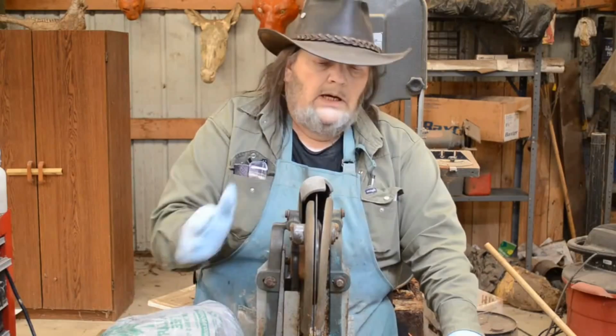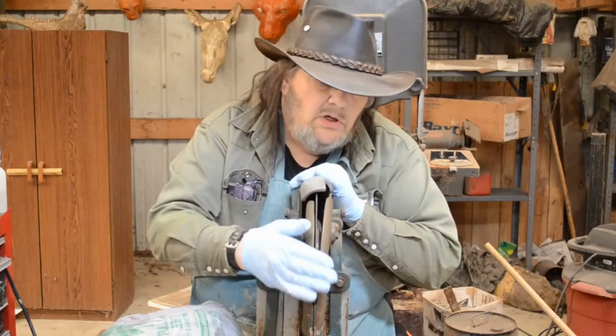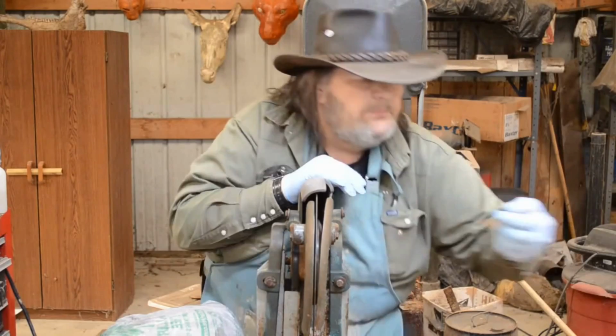It is a circular blade with a turned edge so that the blade is like so and the edge comes out at a right angle. And you can control the amount of hide you're going to remove by how you use your sharpening steels. The little sharpening steels I have here are very simple and nothing fancy. They are hardened steel.